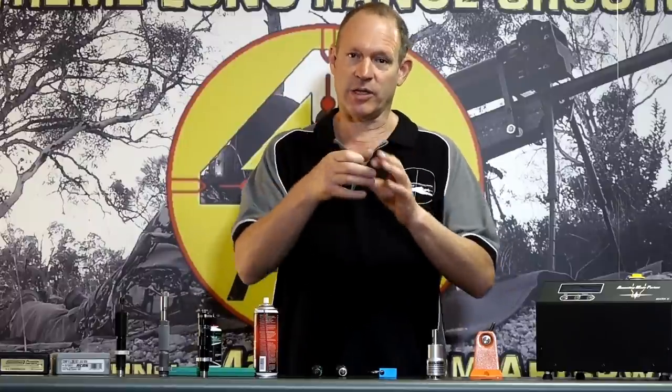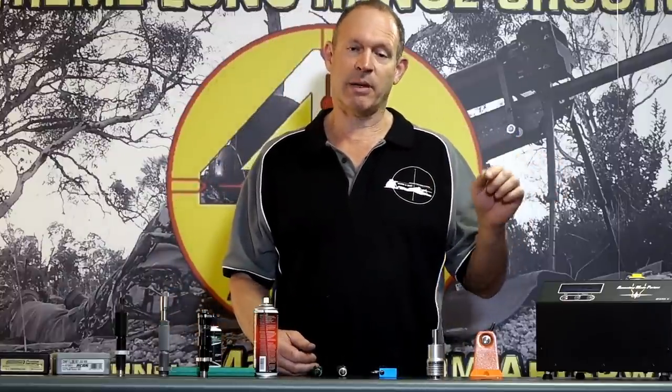So the main reason I neck turn is that I'm wildcatting and I've shrunk my neck down so it's smaller, so it becomes thicker, and then I've got to neck turn it out. That's as simple as that. Some of the other brasses, where the brass has been made, it's been heavier. Some of the 50 BMG stuff started off at 25 thou, very, very thick brass, so I pulled that back down and shaped it all back out. But that's why I neck turn when I neck turn. Largely, I don't need to neck turn at all, but that's the reason I do it. Not to say there's not decent logic to going with concentricity and making it dead straight, but I don't even have that gauge. My rifle, I haven't had to fix that problem.